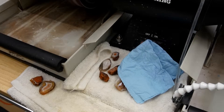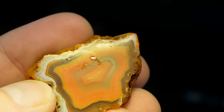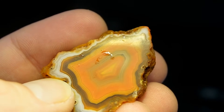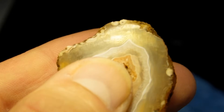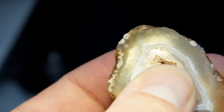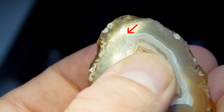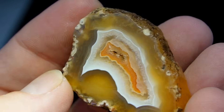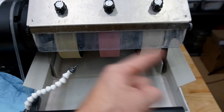Out of the seven we're working on, two of them need a little fix. This beautiful one just had some light fracturing, so I'm going to step back to 280 grit and then run it through 600 again — that should knock it out. And this other guy has a couple of grind marks from the flat lap, right above my thumb. I'll put an arrow on it. Got to get those taken care of before we can move on, then we'll whip through the rest.